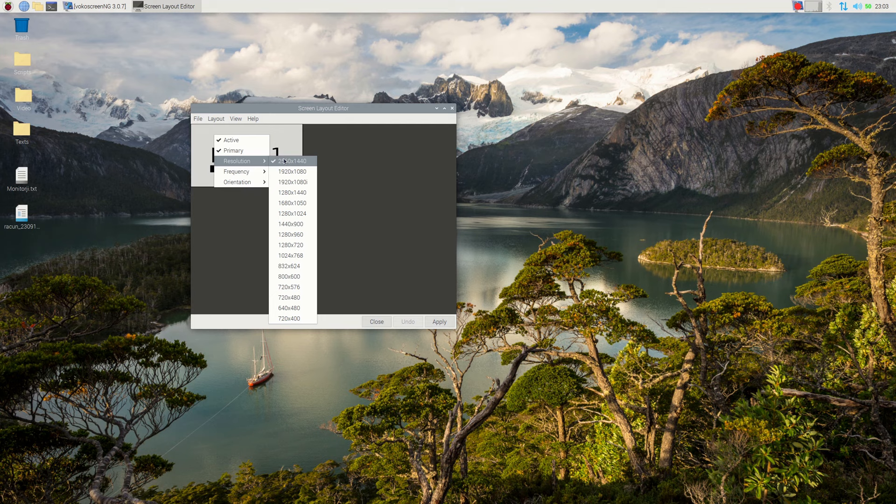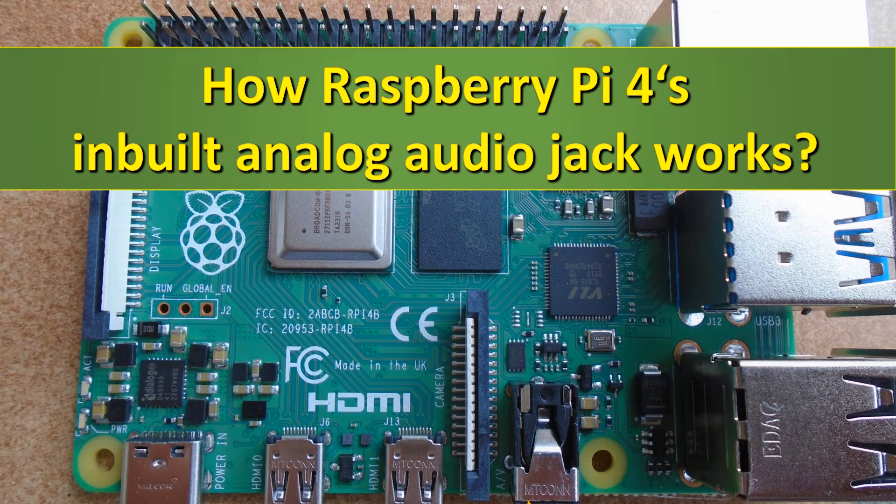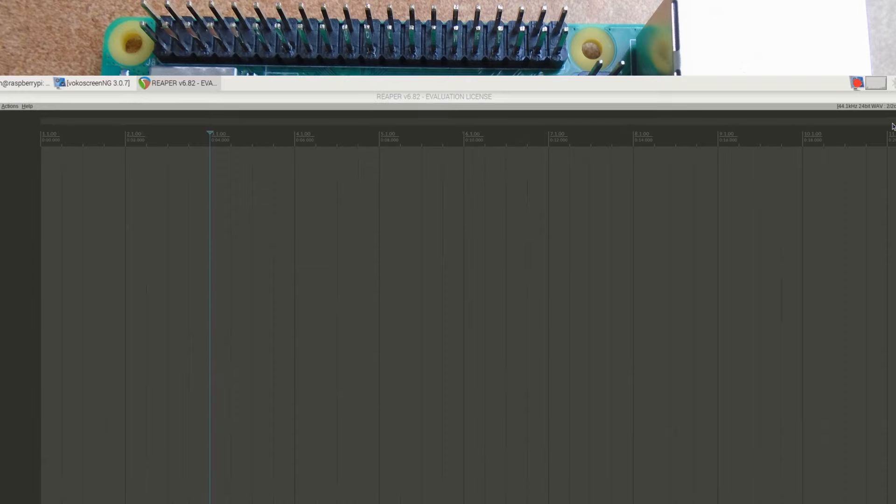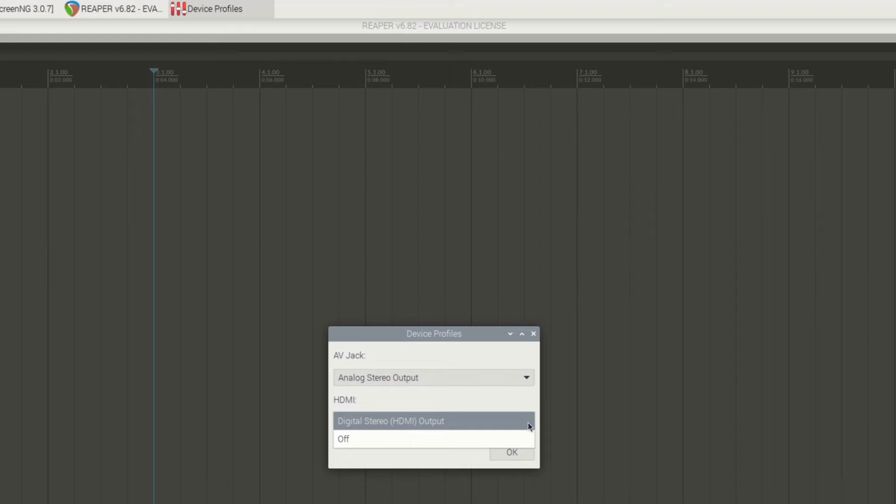What about audio hats? HDMI audio extraction dongles and USB analog audio dongles can be used with any computer with an appropriate HDMI or USB port. However, hats can only work with Raspberry Pi models and versions that they have been designed for. A hat completely covers the Raspberry Pi, which may obstruct its cooling.